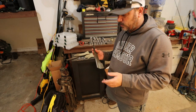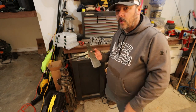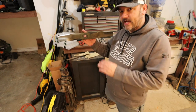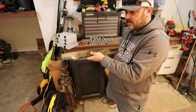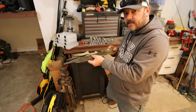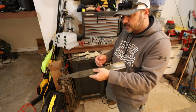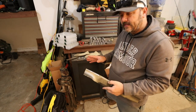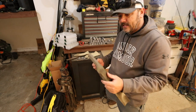Something else to keep in mind when you start sharpening these over and over: you are going to want a blade balancer. That's going to make sure you're taking the same amount of metal off both sides. If you have an unbalanced blade, it's going to cause a lot of vibration under your deck and premature wear on your spindles. First and second filings are no big deal, but after that you will want a blade balancer to keep these balanced.